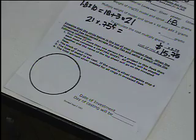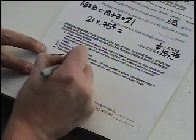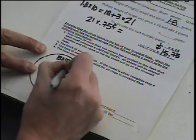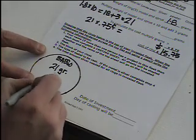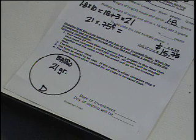So on this, I'm going to continue and write that on here. So, the total weight is 21 grams. And the block is D. Now this allows us to track these things throughout. Now you've finished the spruing step. That's step number 2 completed. The next step is a real important step. It's the making of the mold. Step number 3 is called investing.